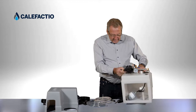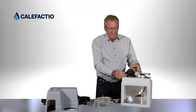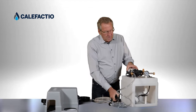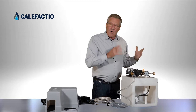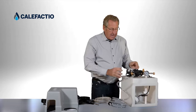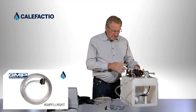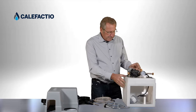Starting with the filling kit: the filling kit comes with a small hose that goes into this valve. When you want to use the filling kit — which is a very nice feature — there's a six-foot hose you can screw to the inlet. You turn this valve 180 degrees, and instead of the pump taking glycol from the tank and refilling it four to six times to fill your system, you can use a larger barrel, like a 25 or 50-gallon barrel. Drop the line in and the pump takes liquid directly from that barrel. Once done, remove the hose and turn the valve back so the pump takes liquid from the tank again.